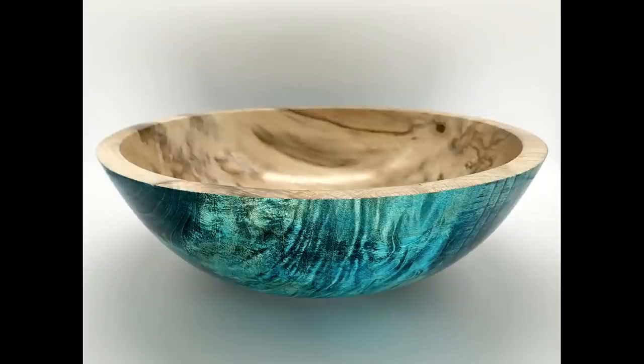That bowl was quite chunky, I suppose, about half an inch, 12 mil. So there was no stain going to creep through there anyway. But the sanding sealer definitely helps. Remember what we said, no sanding sealer if you want to apply on the stain, but the sanding sealer will act as a barrier if you want to create a line. Thank you. And then the two ash ones.